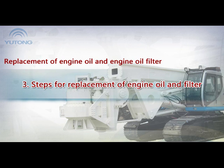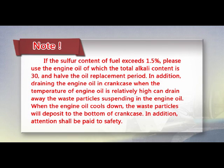3. Steps for replacement of engine oil and filter. Note, if the sulfur content of fuel exceeds 1.5%, please use the engine oil of which the total alkali content is 30 and halve the oil replacement period. In addition, draining the engine oil in crankcase when the temperature of engine oil is relatively high can drain away the waste particles suspending in the engine oil. When the engine oil cools down, the waste particles will deposit to the bottom of crankcase. In addition, attention should be paid to safety.